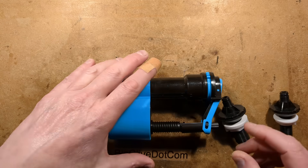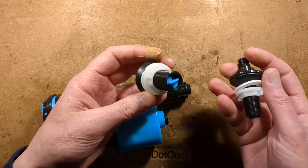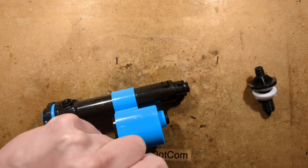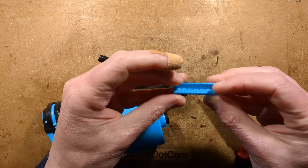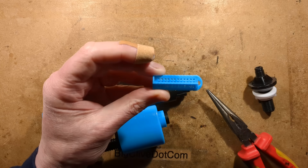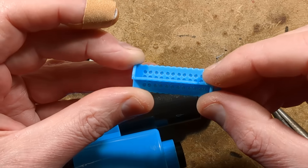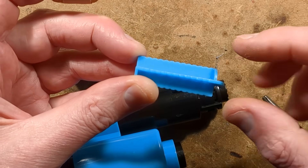It also has so many other features. You choose what size of pipe connector you want, and these actually have a little filter. The filter itself is quite clever — it's used to reduce the flow rate of water. It's been injection-molded, but one side is smooth and not perforated, while the other one is perforated. It's only been perforated on those two faces, so water can only easily travel through that perforation and into the void to continue. It can't go straight up. Very clever.